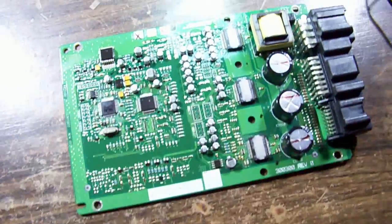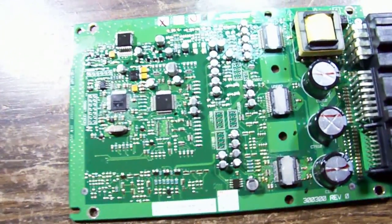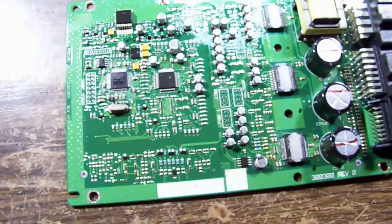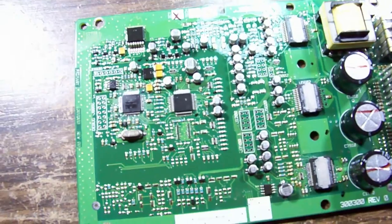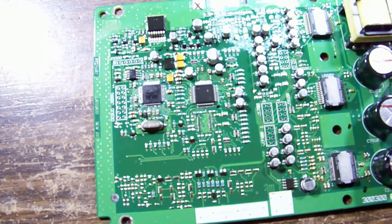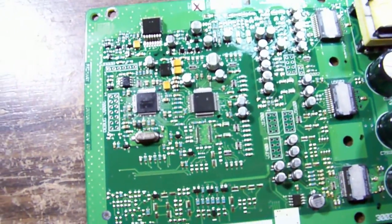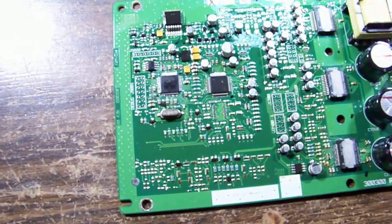Another thought I had is, being automotive, often manufacturers will provide updates to their different modules, like your ECM and your TCM and your BCM and all the other modules in the car, sat nav, whatever. And maybe there's a slim chance that this was receiving an update, and it may have crashed during the update in a way that caused it to just wipe its memory, wipe its program. It's a bit of a long shot. I don't know if any updates would ever be released for the amplifier module, but anything's possible. It's a bit of a strange thing to have happen.